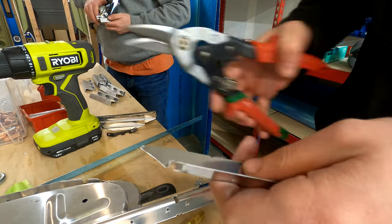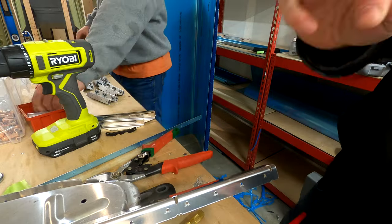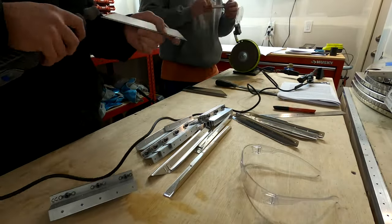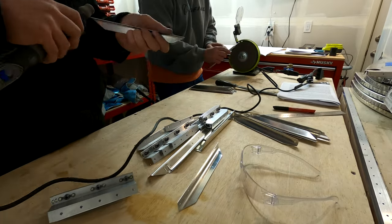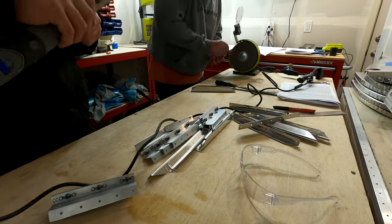These go on the underside and help carry the weight of the fuel that wouldn't be there in the leading edge. Because of the brackets and the stiffener, as well as the baffle and the fact that the tanks are sealed, there are some differences in the order of operations in which you build them, and the reason why you build them on the spar versus on the table like you saw me do to the leading edge.